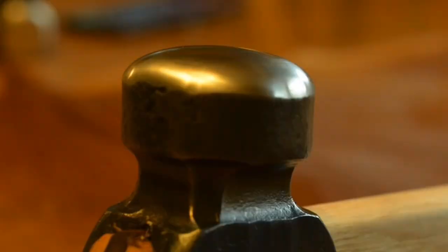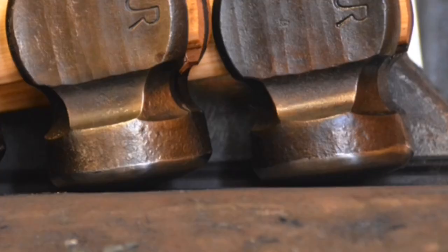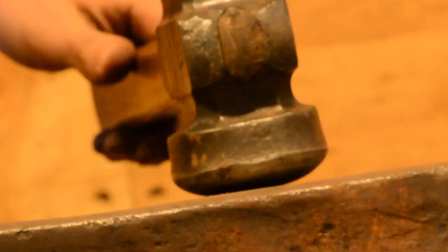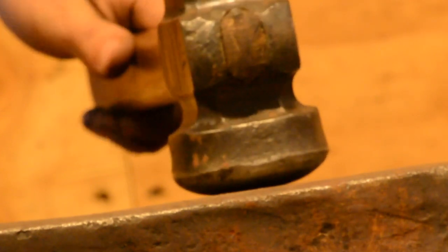As far as the geometry of the round face is concerned, it's a little bit more complicated than just a dome, in that it's a squashed ball. So the radius on the very center of the round face is more than the radius on the edge. As you tilt it towards the edge, the curve gets sharper, so to speak, and that's what lessens your surface area contact. That's why you have the infinite amount of dies, as people call that. So that's the geometry of the round face, and that's really important. You can see on the close-up here how that tilts and how that works.